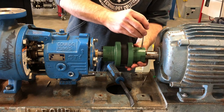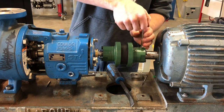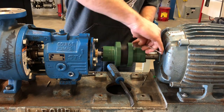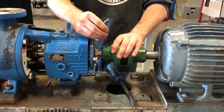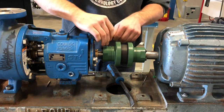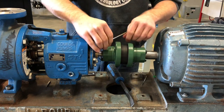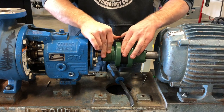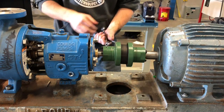One final thing I wanted to point out on putting this coupler together is that I made sure the set screws and the keyways are 180 degrees out from each other — that's just a precision balancing technique people use, and it may be a test question in an upcoming test, so definitely watch out for that. That pretty much sums up our video on how to rebuild this pump. Next thing you've got to do is go out and get started on it for yourself. If you have any questions or anything I can help you with, please let me know.